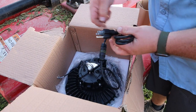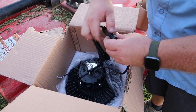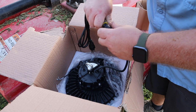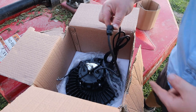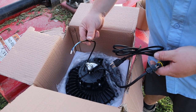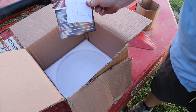It comes pre-wired and pre-terminated with a US style plug, 110 volt with ground. We're not going to be using that — I'm going to hardwire these into his junction boxes in the ceiling. For that it's as easy as twisting apart this connector. I'll clip the wires but reuse this portion of the connector as a pass-through thimble for the electrical box. This other little wire is for dimming — if you want to add a dimming option you can hook it up to a separate switch — but we're not doing that here so it'll just get tied up out of the way.